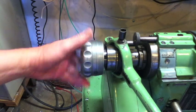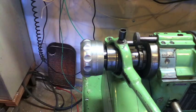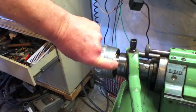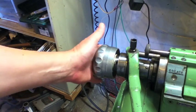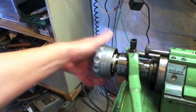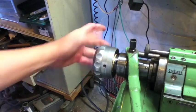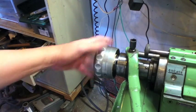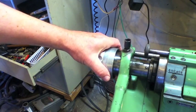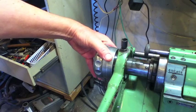I'm going to put this back in and show you how these come out. You can see them move out as I push that forward. I'm going to continue to set my collet into the drawbar — quite a bit of turning. And now you can see them come out; I'm going to have them come out just far enough. That's too far — I can't get that over-center click. There we go, and they click over center.